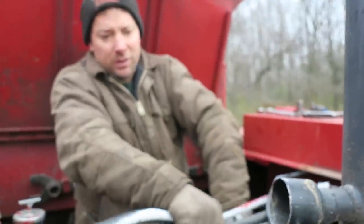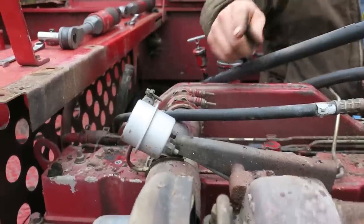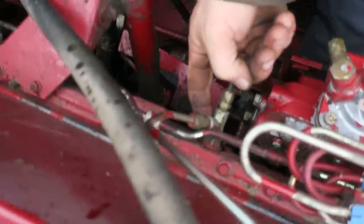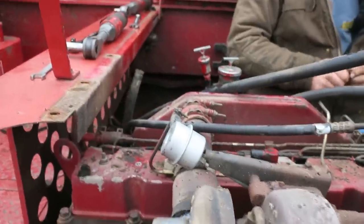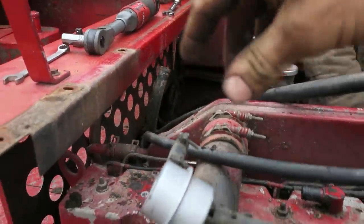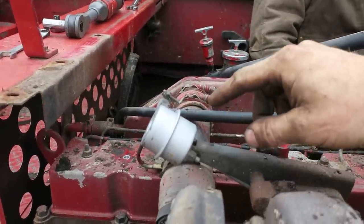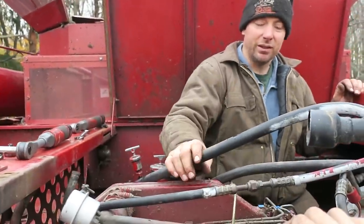For a combine with overheating issues, you'd think they would have put the chute out straight rather than a sharp 90 there. The exhaust breaks all the time — it's been welded, had new ones. You should have a little flex pipe here. This is a common problem on old Magnums and 8900 Magnums — anything with a wastegate on it. Those diaphragms leak, and there's a little orifice off the intake manifold that can't feed the line fast enough to compensate for the leak. The line goes to your aneroid valve, and if your aneroid valve doesn't open, it won't full fuel — but you don't notice any difference in how it runs. All you have to do is take pliers and pinch this off to keep your boost pressure up. That's an easy way to tell if this is damaged. Just pinch it off and leave it off and she'll be at full boost all the time — but that'll overheat, so you can't do that either. It's a simple diagnosis.